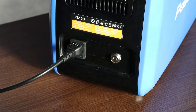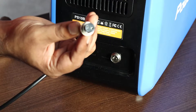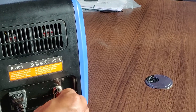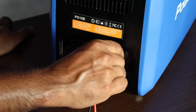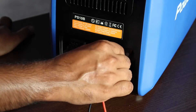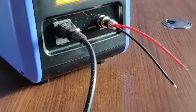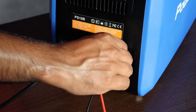You can directly charge this using your mains — no special adapter needed as it has a built-in adapter. The solar connector is a dedicated proprietary type, not the generic MC4 type, so you'll need to solder your wires to the solar panel. Alternatively, you could add XT60 connectors at the end to make the solar connection portable.